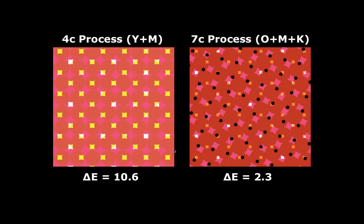that that's the color. The color that you see on the right is the color that I can achieve, and I will sign up to match that color within a specified delta E, usually 2 or 3. So you basically re-zero on the color on the right, and then you sign a contract or whatever, however you want to agree to terms, to match that color within 2 to 3 delta E. Not the original color. You want to match the converted color.